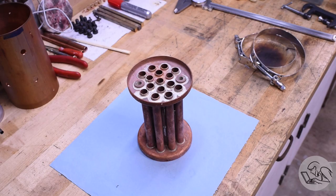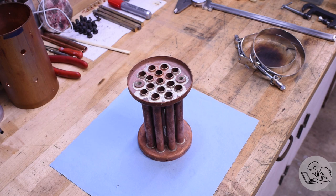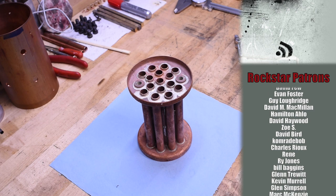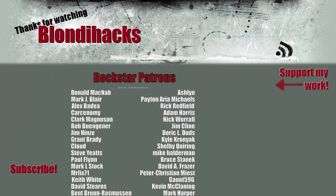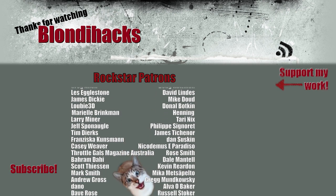I can't say for sure that tube joints good at 60 psi will be good to 120, but I think this exercise was definitely worth doing. I could try different gasket material, more clamps, or more robust end plates, but I've put quite a bit of time into this and I think I've developed the confidence I needed to go ahead and finish soldering up this boiler. I hope you enjoyed this little exercise — thank you very much for watching. If you can, throw me a little love on Patreon; that's really what keeps this content going. I'll see you next time.